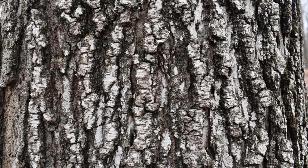If you're going to do a lot of under your lateral, go with the check valves. So you run check valves on everything, or just if you're below your lateral? Everything that we can. We have one of the larger research areas, 1,200 trees where we require them. So everywhere that we can, we're using check valves.